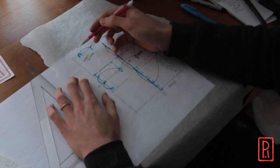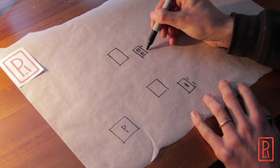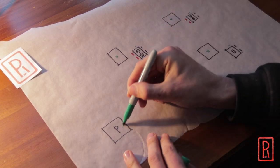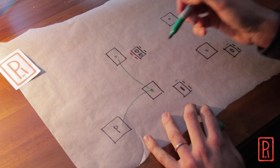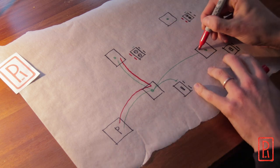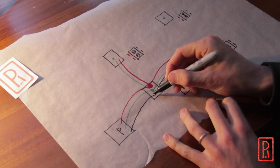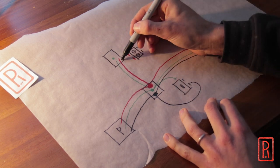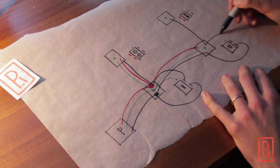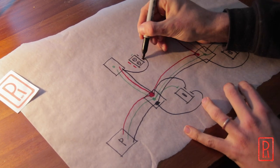One of my concerns in designing this electrical system is that I wanted to run all of the lights on one breaker. Power basically has to go through the first switch and carry to the second switch without being able to be turned on and off by that first switch. Here's a diagram of that system: in green we have the ground wires, in red the neutrals, and in black the hot wires. The hot wire carries through to the second switch box in the first switch box, then gets interrupted by the first switch and links the first switch to the downstairs outlet for the lights. I won't go into detail about all these connections because I'm not an electrician, and if you don't feel comfortable doing this kind of work, you shouldn't attempt it and should call an electrician.